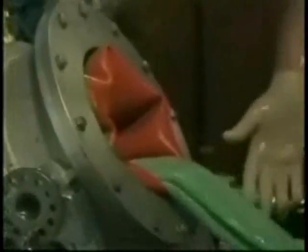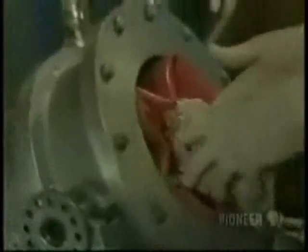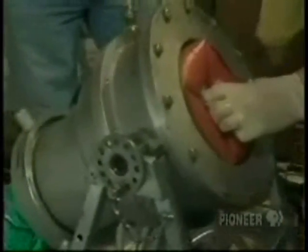What are you spraying on that? Vegetable oil. What's that doing for you? It's lubricating it so it slides a lot easier through the tube and down through the pipe. How far out are we with the liner right now? We're halfway. I'm going to put the rest of this into the chamber, fill it up with air, and we're going to shoot it out and the elastic will carry it all the way out to the end.